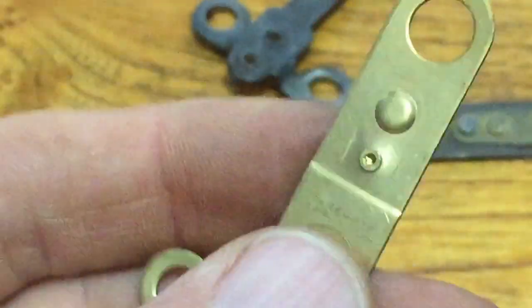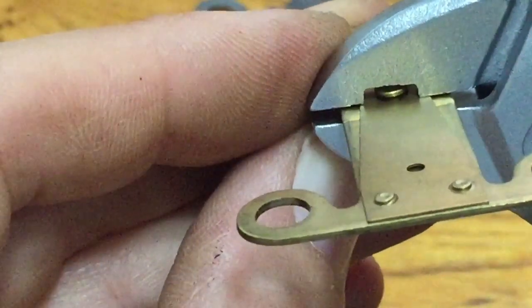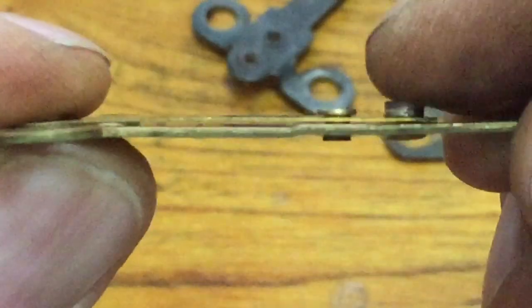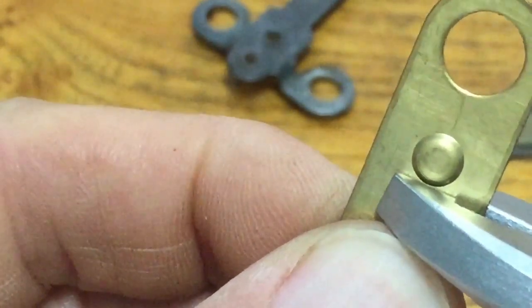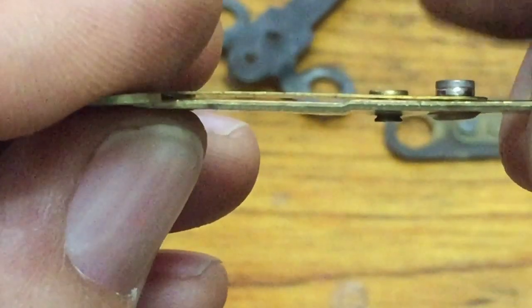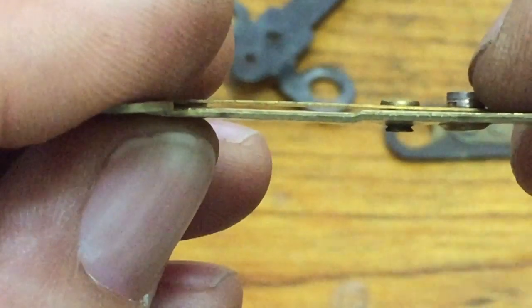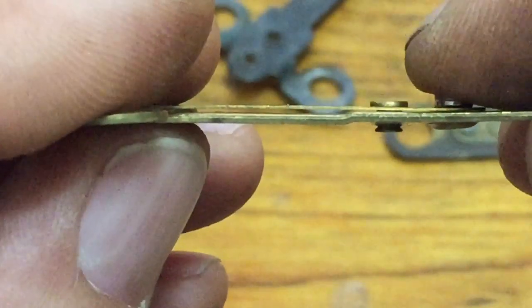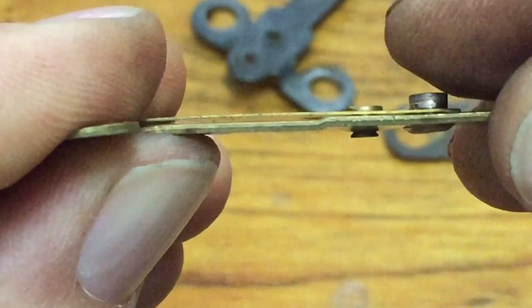I think I've maybe overdone it. If there's a thousandth of play, that's about it. I can go back here and gently press it — yeah, that's a lot less than original. I can go back and forth either trying to press the rivet or just flatten the rivet head. This is just a few thousandths of movement. Some places say two or three thousandths, some say five, but most people agree when you go over five thousandths that's too much.